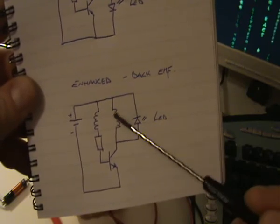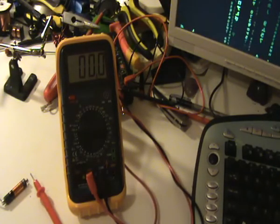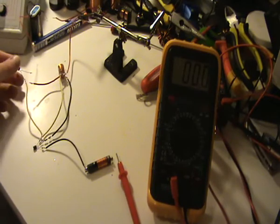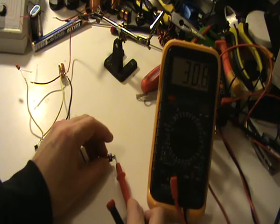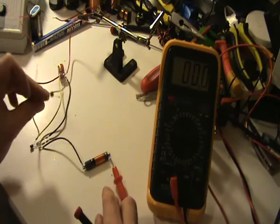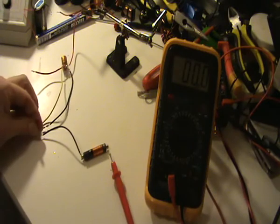The beautiful thing is that you use way fewer amps when driving it this way. I built the setup very simply and I will show you what I mean. This is the amp meter. At first I will short circuit the Joule Thief without putting any load on it — and as you see on the amp meter I draw 30.8 milliamps. Now this is the LED. At first I will connect it like in the standard Joule Thief version, putting the LED over the collector and the emitter.